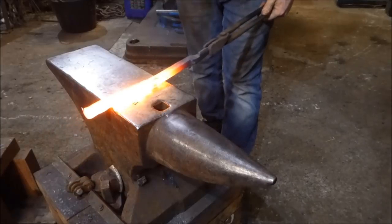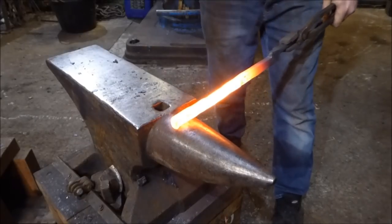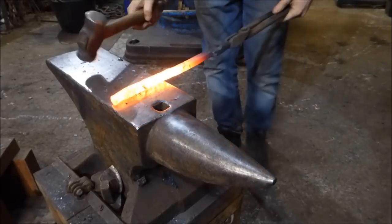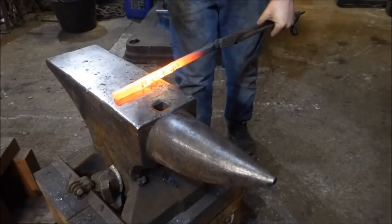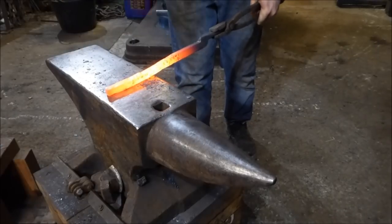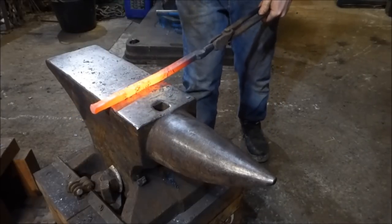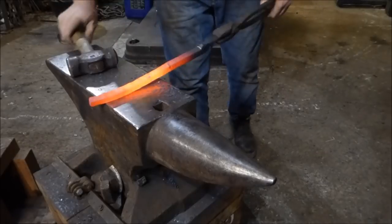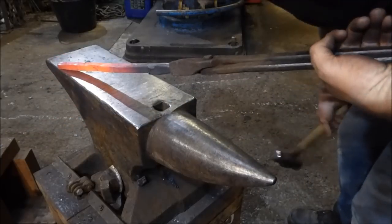I'm just going to come to the flat face of the anvil and straighten everything up. I've got a lot of weight here in the end. I'm just looking for those high spots and taking them out. I've got a nice high spot there — get rid of that, that's gone. I've got one here — gone. One there. Now what's happening is where I've taken those two high spots out, I've given myself another one here. Flatten the hammer this time. Now I'm just going to come along the length of the anvil and blow away this scale.